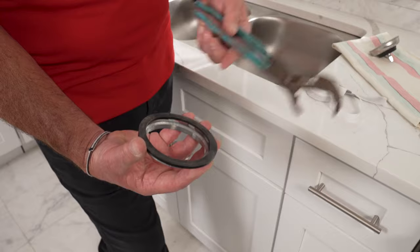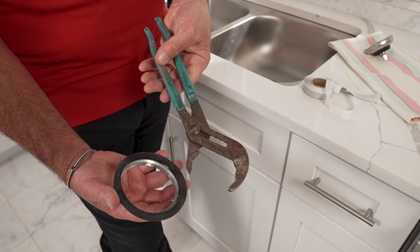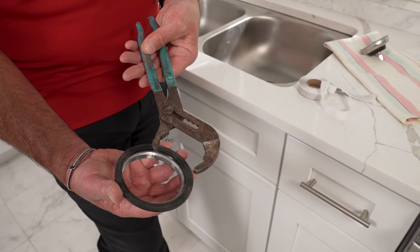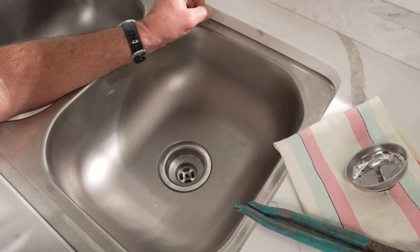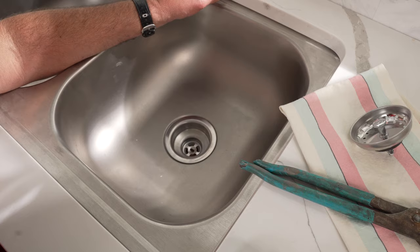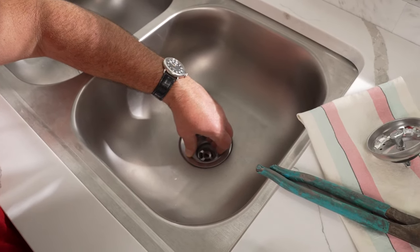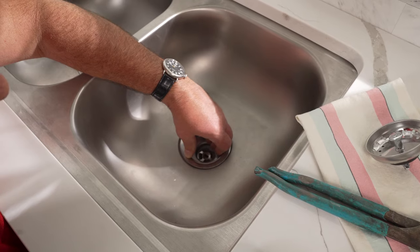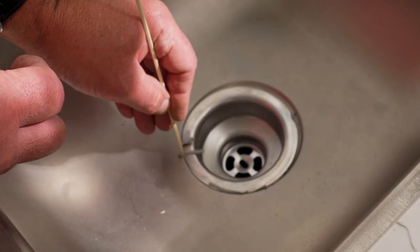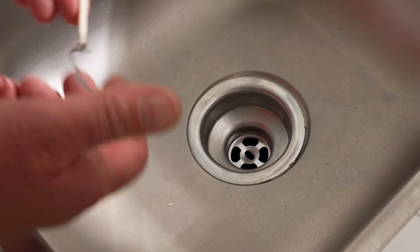You're going to tighten it using a large pair of channel locks like this or a pipe wrench, but be careful — you want to get it nice and snug. As you tighten it, you're going to see the putty coming up from the top. With the nut started, I'm just going to use my hands to sort of tighten it. Keep in mind that once you start to snug this down and use the channel locks, this is going to want to rotate on you. The whole idea is we just want to get that putty to start to squeeze out. You want it tight, but you don't want to over-tighten it. You see all that putty that came up — that's a good thing. Then what I do is take a little skewer and start to just tuck it away.